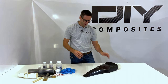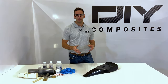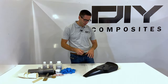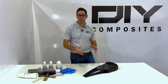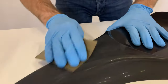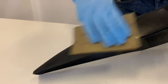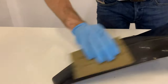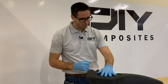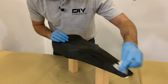It's worth noticing that the surface of our component is very shiny at the moment, so if we were to laminate straight onto that, getting a strong bond would be quite difficult. So the first step in the process is we need to prepare the surface by abrading it back using 120 grit paper so that the resin and the carbon fibre cloth can make a strong bond. We've now thoroughly abraded the surface with 120 grit paper, so it's important that we degrease the part using one of our alcohol wipes included in the kit.